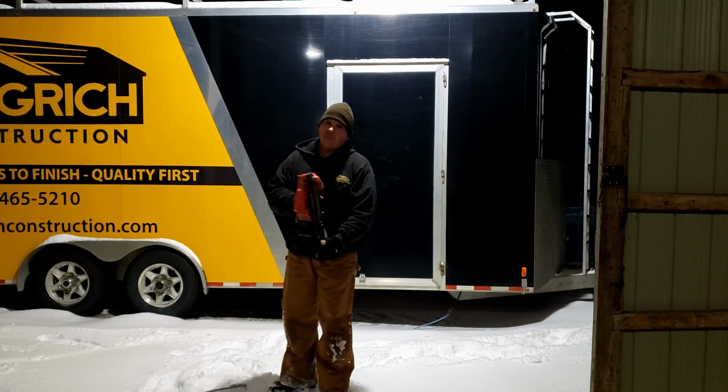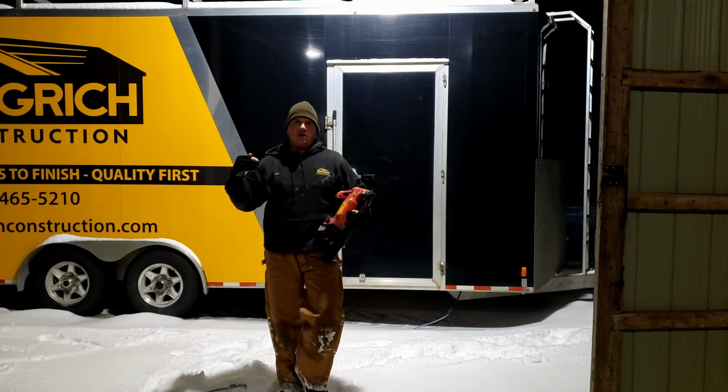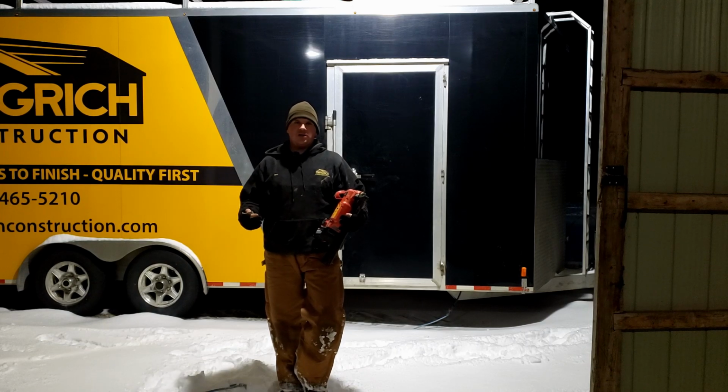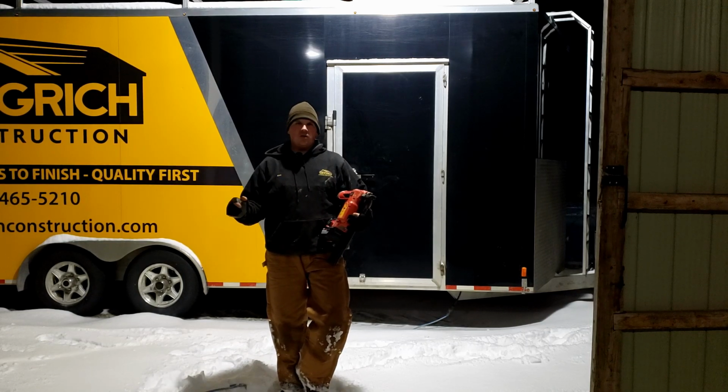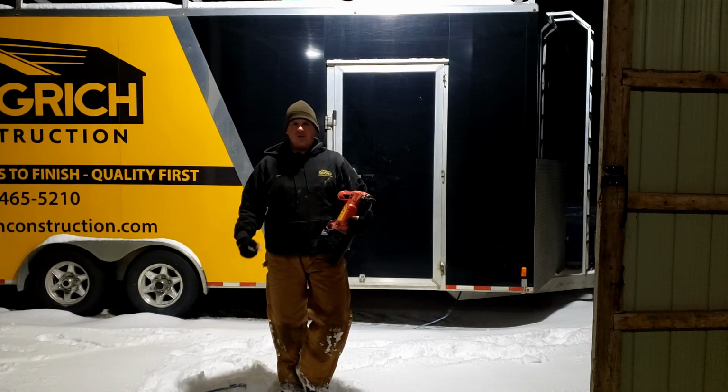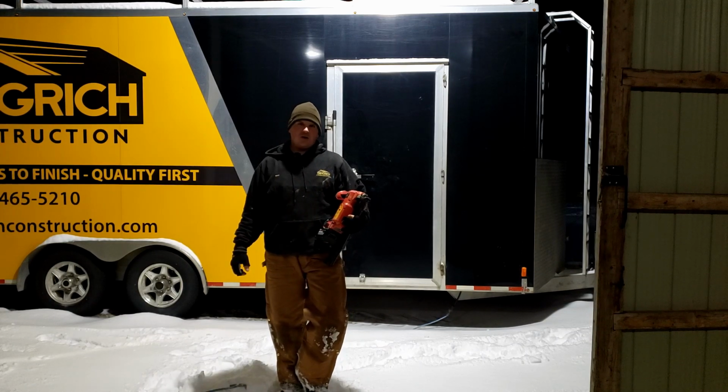And if you're setting up and you're strictly doing production framing where you can have a central air compressor, you don't have to be running hundreds of feet of hose or anything like that, and you're able to lay it out in a way you don't get hoses tangled, air nailers are the way to go. Particularly in the summertime, they're light, they're fast, and they're economical. But if you're doing a lot of climbing, and say you're doing trusses or something like that, working on the roof, then we would definitely vote to the battery nailer.